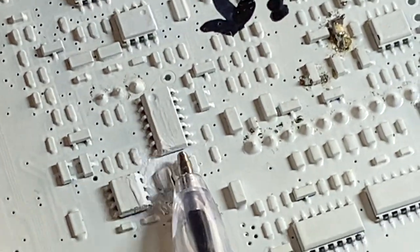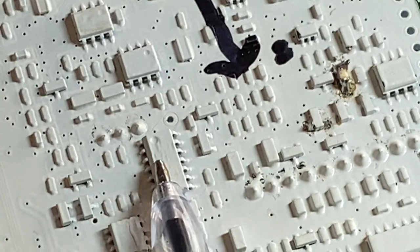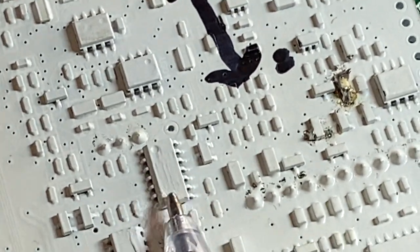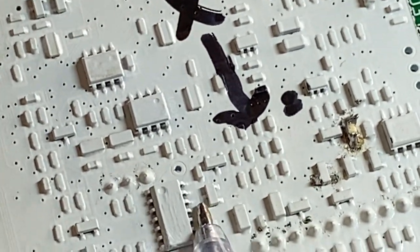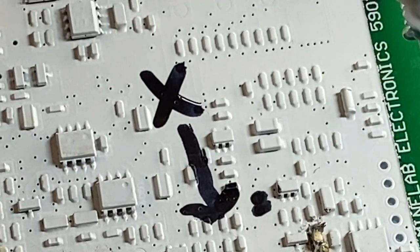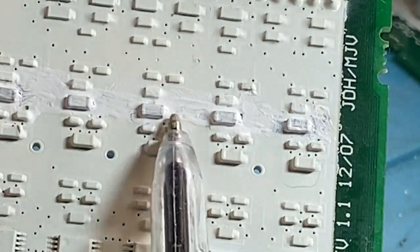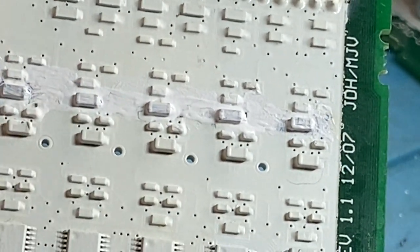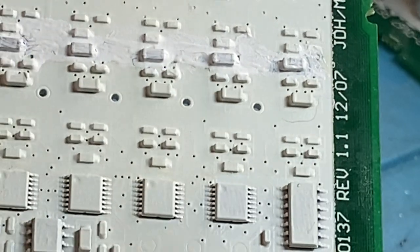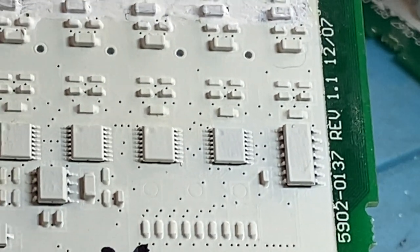Where am I there? This one here just mixes the pulse width modulation for the audio and the amplitude together for a couple of transistors that sit there. But up in this end here, you may find your detector's gone chattery, or it's not ground balancing properly or something.